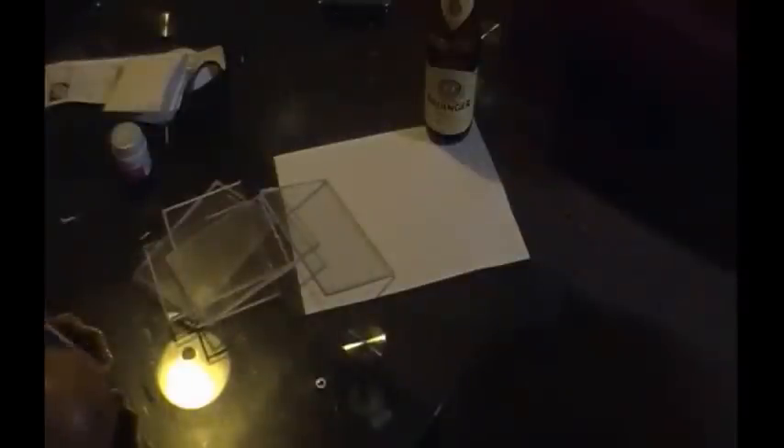Those raised sections will interfere with the gluing process. Once I've broken that edge off, I'll just take a file and pass it along there a couple times until there's no more bump at the edge. I'll do the next side. That one's nice and smooth on two faces, one more face to go. I've chamfered all the edges on these seven pieces of plexi here.